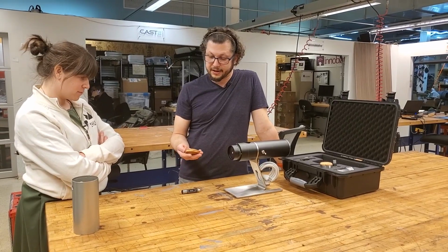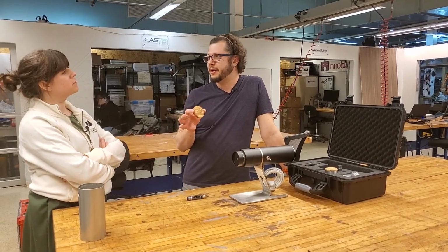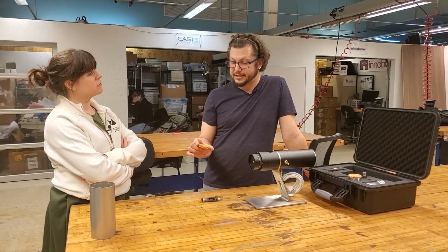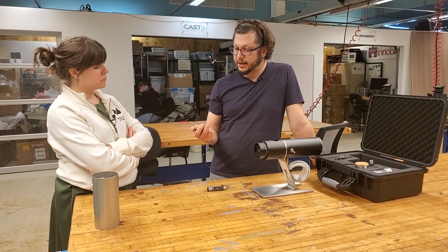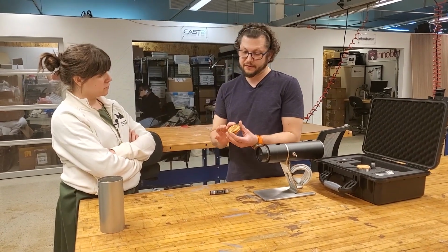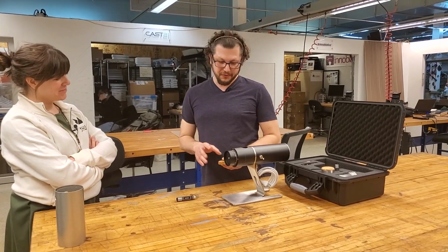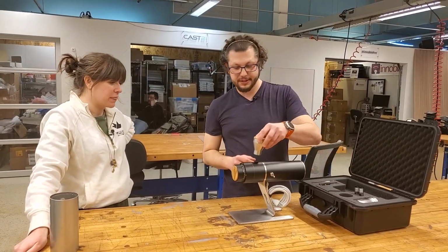And we sanded it here at mHUB. It's actually a really long process. So we cut it on a laser here at mHUB. We engraved it on the exact same laser that cut it, and we took it to the wood lab, and then we sanded it down to a perfect circle, and we put this little chamfer on it, and then we sanded it down again. And then we finished the whole thing here at mHUB. Or actually the little funnel cap.